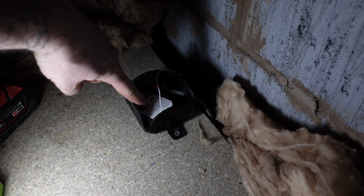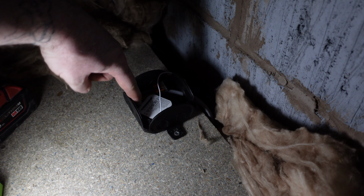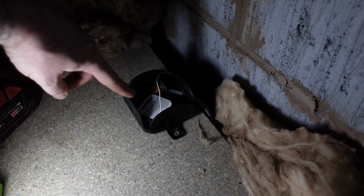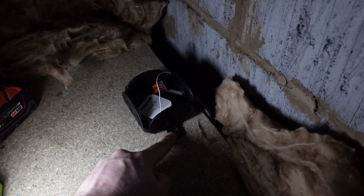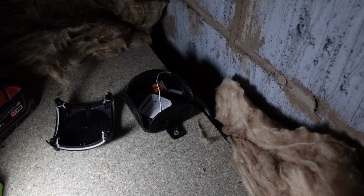My battery's gone, so the lighting is actually terrible now. So there's our receiver in there. I've wired the earths together and connected live and neutral and live and neutral for the feed out. So that's ready to go now. I've screwed it down with the little tags provided, and then this lid will just go over it when we're finished. But I'm going to leave that off for now so we can set it up in a bit.